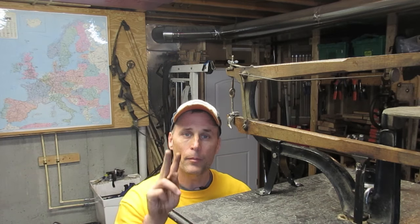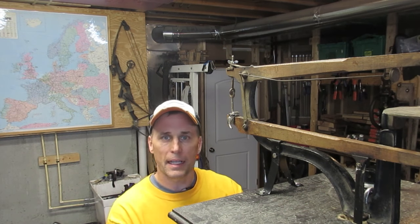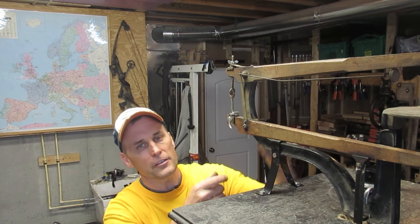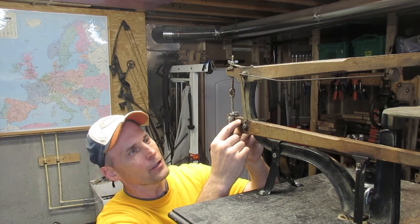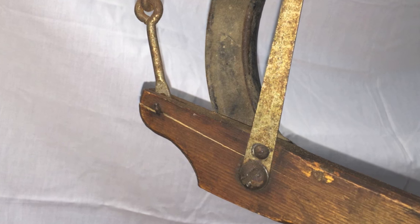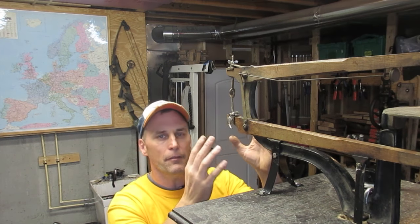For my second learning slash mistake: I started to use it again and broke two more blades. Upon inspection I found that the blade itself was not pulled very tight, and that's because there was a crack in the back. The tighter I tried to make it, the more it spread out. So I glued and clamped it, and that fixed the problem.